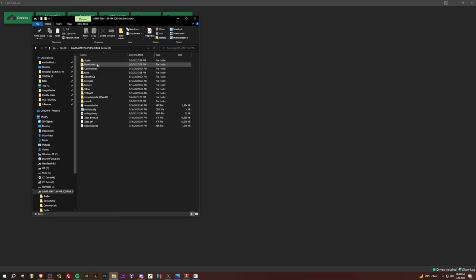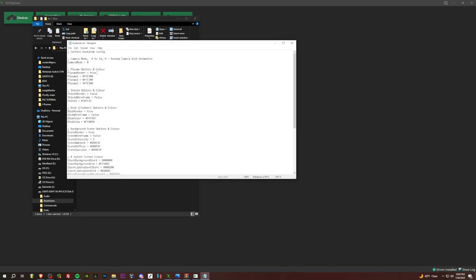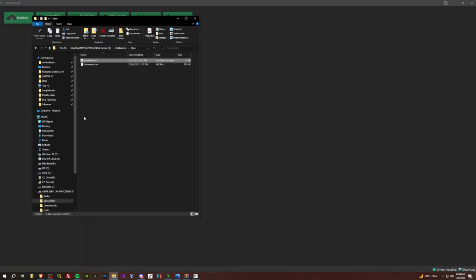Now, if you want to get all bananas and do an X3 kind of boot animation setup for the original boot animation, you come in C, boot anims, Xbox, boot anim.ini, and tweak the colors. Go to some sort of hex editor just to find the hex codes for the various colors and play around. I've got mine that I spent a couple hours on initially when I set up Cerbios, and I just copy pasted. You want to take a look, zoom in, here it is. This is the one I use. I'll leave a link below, maybe a pastebin of my config. But yeah, I like the way mine is. So I have that backed up. I just drag that back over.